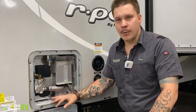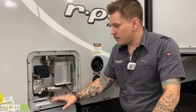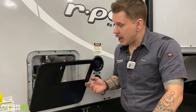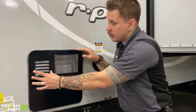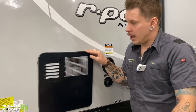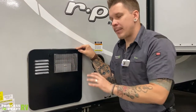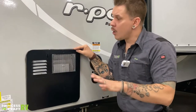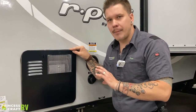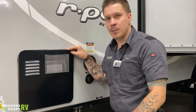The only other thing to address with the water heater is protecting it from flying insects and mud daubers nesting within the appliance. Use a bug screening material to screen the grating and louvers. They sell specifically cut screens on the aftermarket for this, or you can DIY something. The goal is to keep mud daubers from nesting inside — just make sure it's as free-flowing as possible while still providing protection.